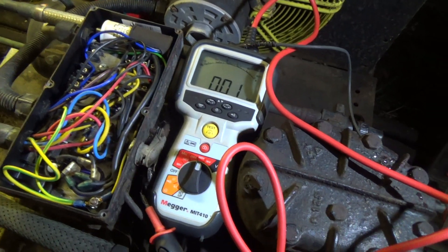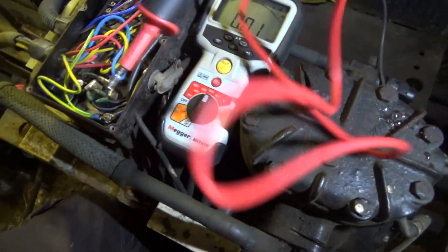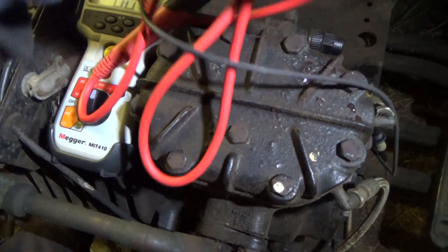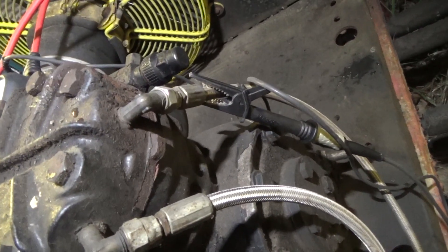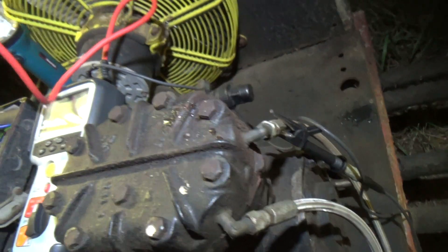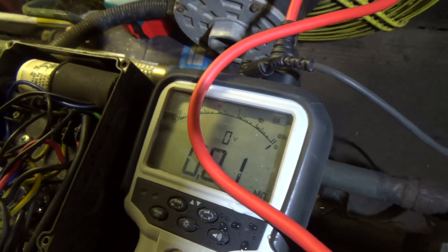I'm not happy. It's a bit tight for space in here. Nice to tie their lead in a knot. We've got the one lead earthed onto that capillary, which is stainless steel — any bit of metal or copper pipe should do. So we'll confirm that by going on the earth post, hit the test button, and that's showing a short.